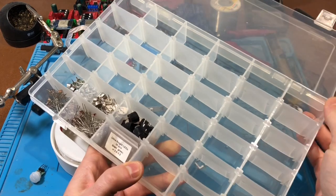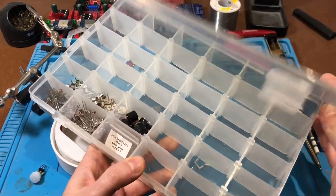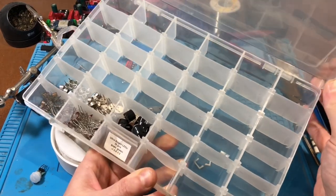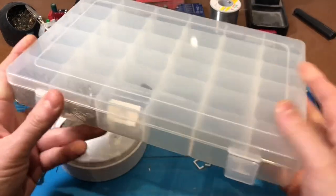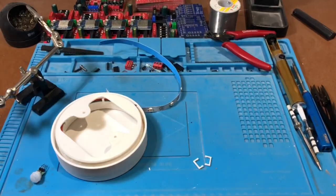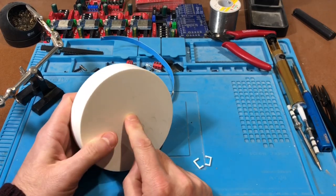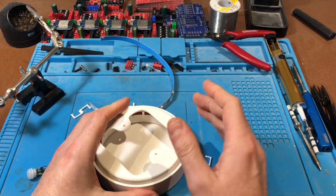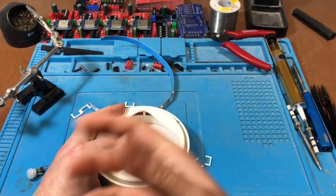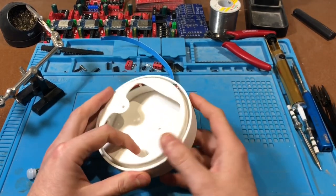And I plan to basically make my own noise sensor, which will have two outputs. One will be a trigger for something like a double clap, and one will just be ambient noise. So I took inspiration from a multi-sensor that's recently been put on the market by Loxone. What that does is it uses the PIR to turn the lights on, and then it uses the ambient noise to confirm that there's someone still in the room, so that if you don't move, if you're watching a movie or whatever for 2 hours, it keeps the lights on, it extends the trigger.